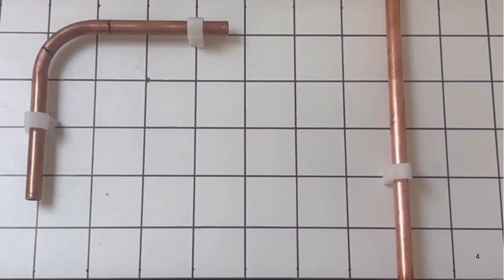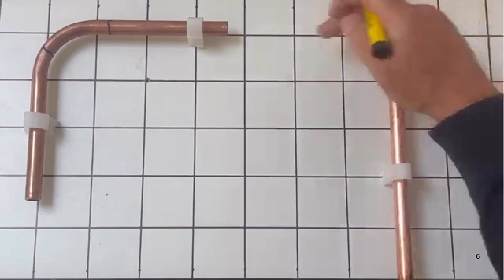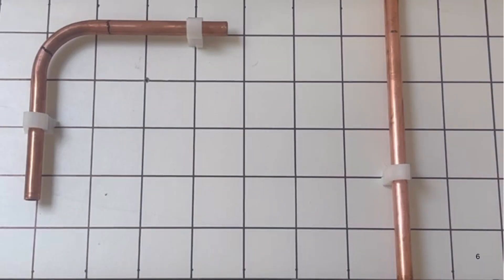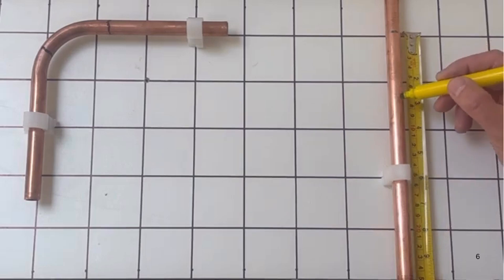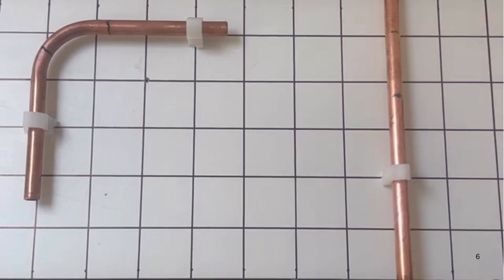What we're going to do today is bend this pipe so it comes in line with that pipe there. We need to mark the centre from that pipe and mark it on this pipe here, so we're going to use the line on the graph board. Put the mark in there, then measure 70mm back from that mark — or 7cm if you're working in centimetres.